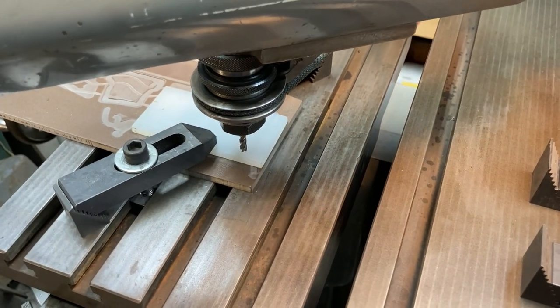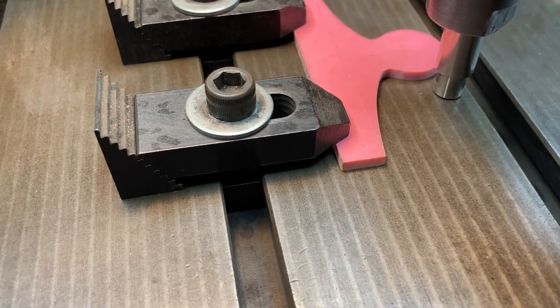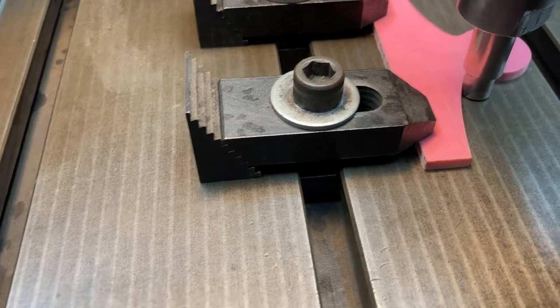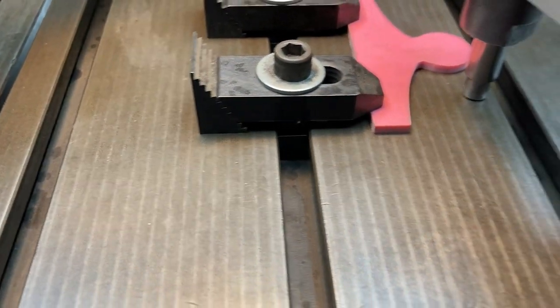And right now I'm starting out with a 5/8 oversized stylus just to do the roughing. Then I'll finish it out with an exactly 0.375 stylus. And we're cutting with a 3/16 cutter, 3/8 stylus, because the stylus has to be 2-to-1 to the cutter as well.